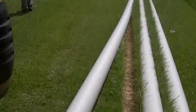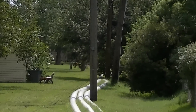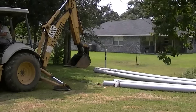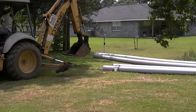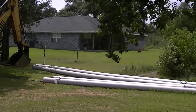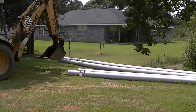Pulled all the drill stem through — air supply hose is attached. Getting ready to drag the pipe around so we can burst tomorrow morning. Now that the air supply hose is in the new pipe that will be installed, they've wrapped a strap around the pipe and are about to drag it down the pipeline easement to have the pipe ready to be pulled in tomorrow.